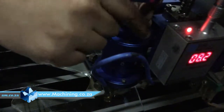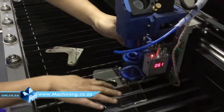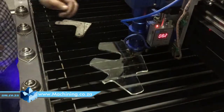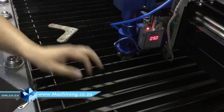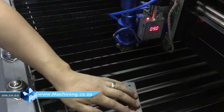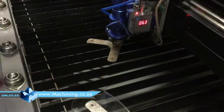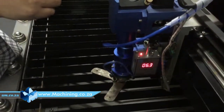About how you adjust focus, I think you can watch other videos — eventually you get the focus right. This is just a protection. Also this is loose because the whole head can go up and down without moving the tall part. Now we get the focus. It is one millimeter distance. Then why do we need another four? It is because they are the same thickness as the perspex — they are all 4mm, so they are at the focus point. When at the focus point, we need to adjust this sensor. This is by capacitance, to 6.1. Remember 6.1.